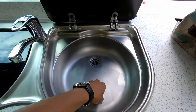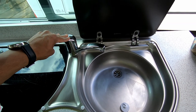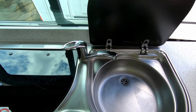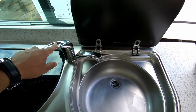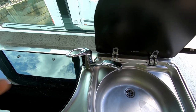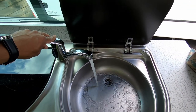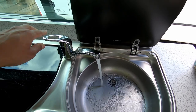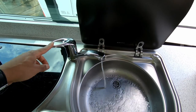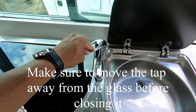This is your sink and your water tap. When you open the tap and close it, if the water pump doesn't shut off, that means there's air in the line — you just need to let the taps run. In the shower area as well, just let it run until all the air comes out. It should then shut off. You've got your hot side and cold side.